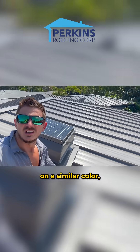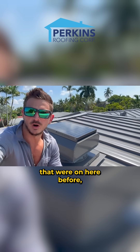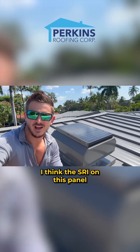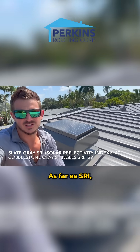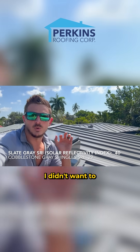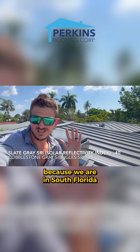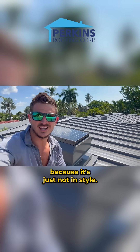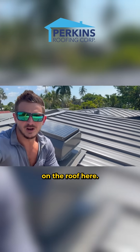I'm putting on a similar color, maybe a little bit darker to the shingles that were on here before. But it's metal so it's probably going to be naturally more reflective. I think the SRI on this panel is like 40 or 50, so it's kind of a mid-grade as far as SRI. I didn't want to go too dark on the roof — like black, even though it looks sharp — because we are in South Florida and you will bake with that. And I didn't want to go white because it's just not in style. So I kind of went with a more neutral — this is the color slate on the roof here.